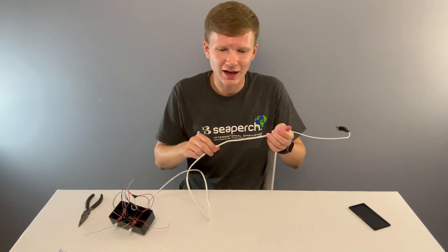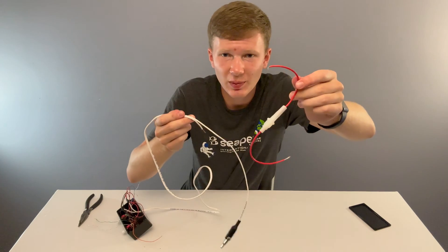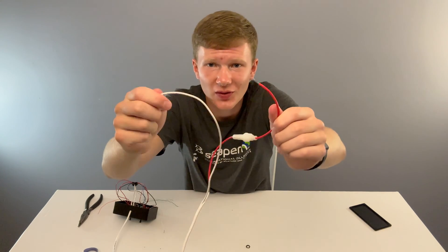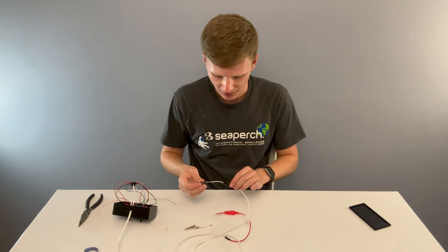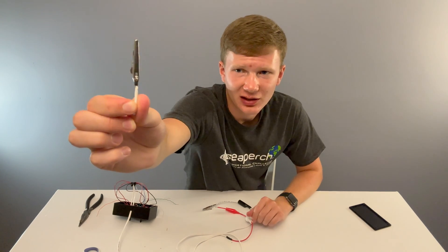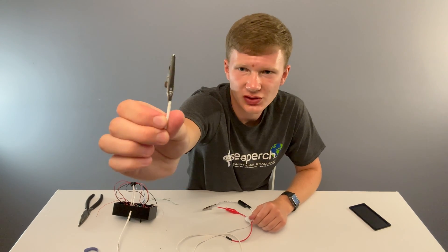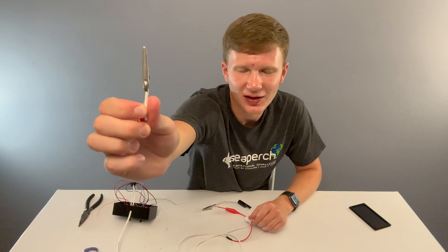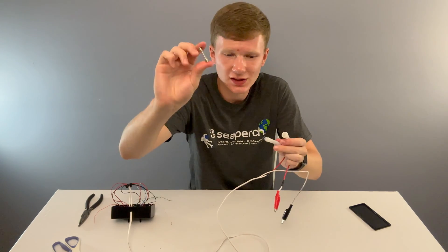Go to the other end of your 18-gauge wire that you split apart. Trace down the wire you decided would be positive and cut off about the length of your fuse holder — we're going to attach it here. Strip all the ends, twist the wire around the fuse holder like this, and solder. Once the connection is soldered and cooled, wrap it in electrical tape. Lastly, we're going to attach alligator clips onto the end of this 18-gauge wire. Take your insulators and slide them on small hole first. Put the red one on the side with the fuse holder and the black one on the other side. Then solder the end of the 18-gauge wire to the alligator clip. Different alligator clips can have different ways to do this — some have a little screw to wrap the exposed wire around, others have little holes in the top. If yours just has a hole, roughen the top a bit using your sandpaper and then solder the exposed wire to that part. Slide the insulators back down over the clips. You can now put the fuse itself into the fuse holder. All that's left to do is test your controller.